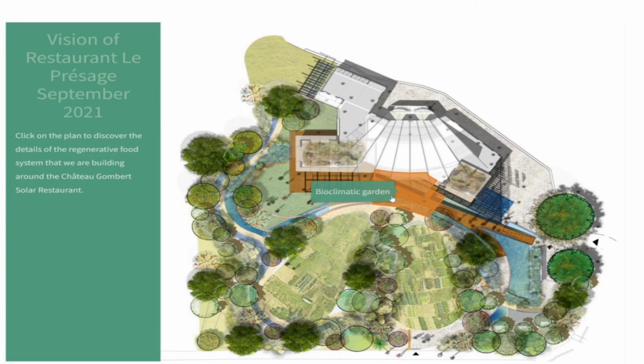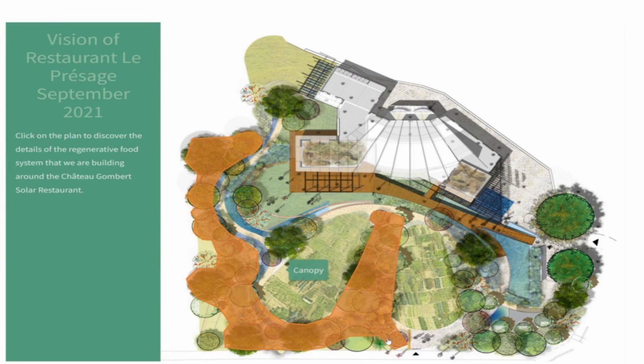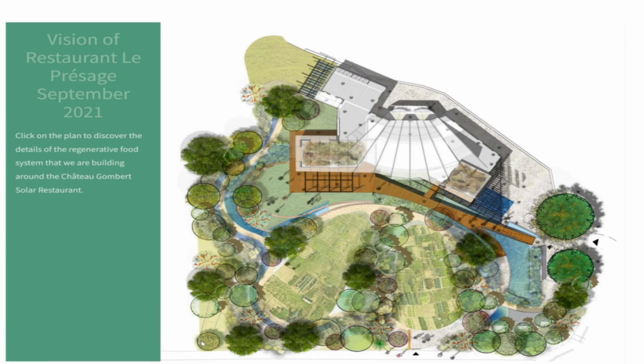And that makes it really interesting, because during the summer, the water inside will evaporate, so it's going to be cool, and the opposite in the winter. So it's a really interesting material. Otherwise you just have a wall, maybe concrete, so it's waterproof, but then you need to insulate it, and so on, and you have condensation problems. And we also have some innovation in the building, or at least the way we're doing it. So I'm really looking forward, because we've been dreaming about that for years.